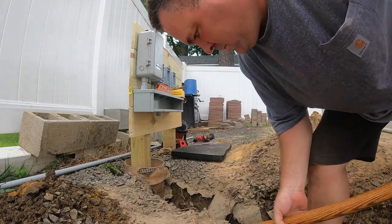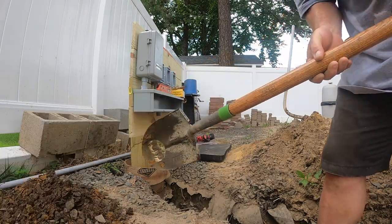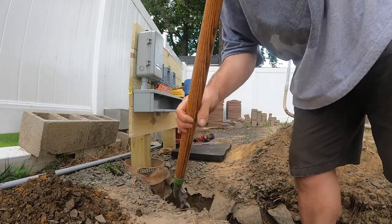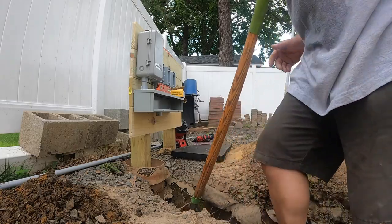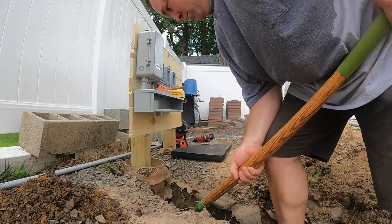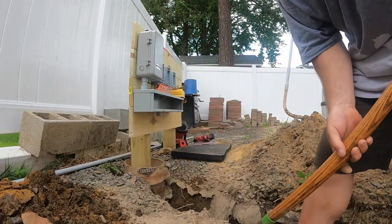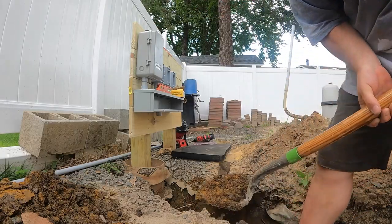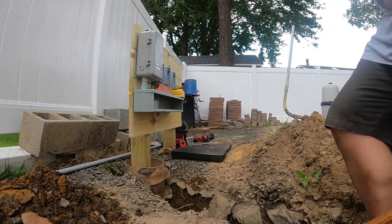What I'm doing here is making that trench a little deeper. It may have rained while I was gone and I might not have had the required depth for that PVC, so I'm digging it out. Then I'm going to install an expansion coupling into the bottom of that trough. It's important to get the depth right — you'd hate to do all this work and have the inspector tell you you're not deep enough. Just do it right the first time.